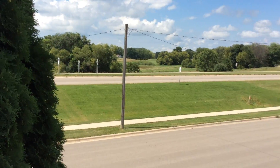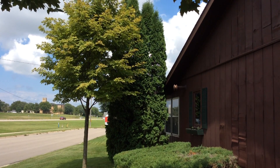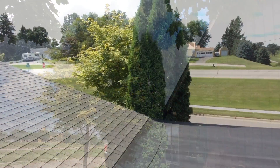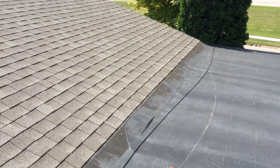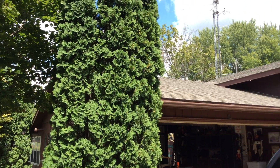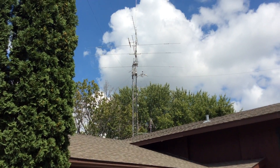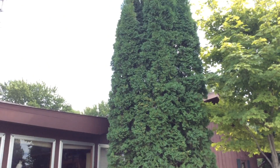If you do a little research on mini whip antennas you can build your own, or there are plenty of opportunities to purchase one online already built by different manufacturers. I chose to route the coax across the roof line like this. I would like to put it up higher off the side of my tower, but I have a lot of transmitting antennas and I didn't want to burn out the front end on this amplified antenna, so I kept it at a distance.